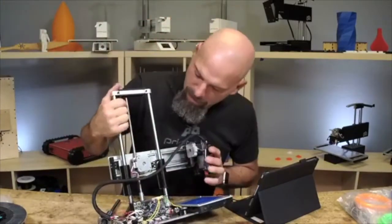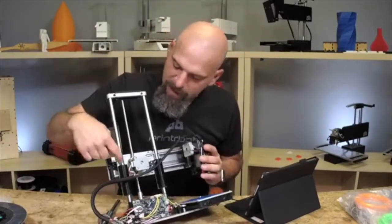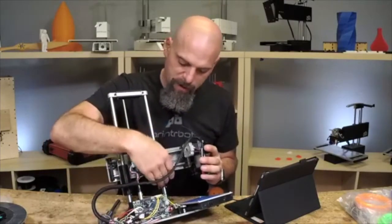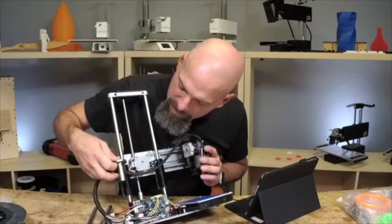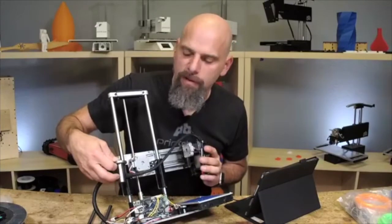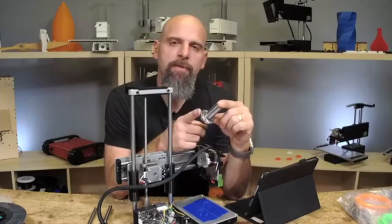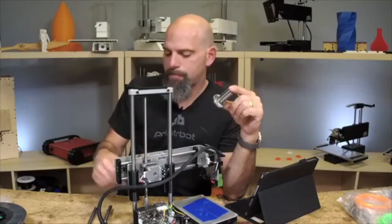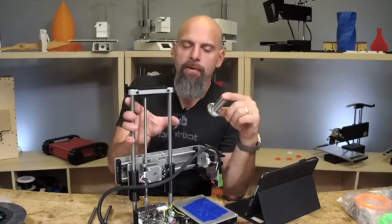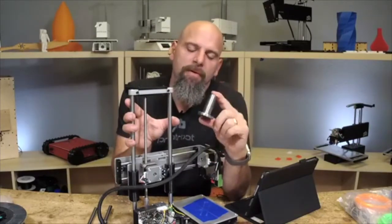You probably can't see it, but if you can, I have 4 bearings on this for this, and then I actually have 4 bearings here. These are 12 millimeter bearings. But see the size difference for these flange bearings? They're actually smaller, and they're plenty tall to use. So while this may raise the cost if you were designing your own bot, you may make these trade-offs using these cheap bearings, to work with 12 millimeter bars. But I'm giving these away essentially for free, and I have so many of them that I can't return them, so I might as well use them.